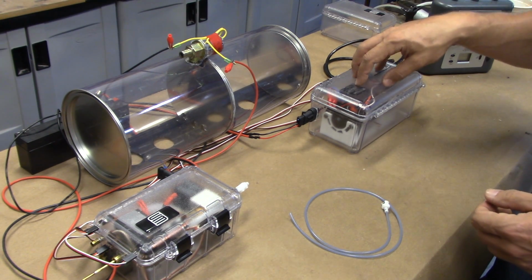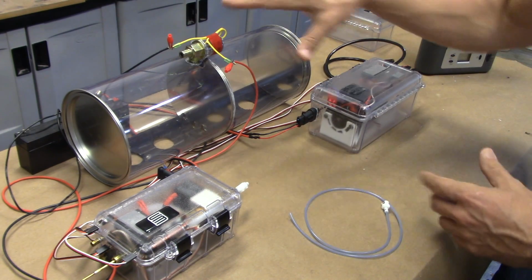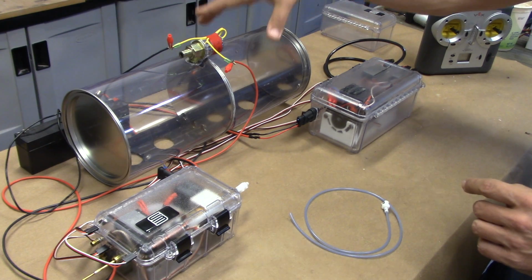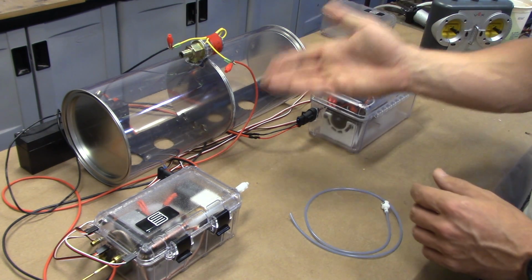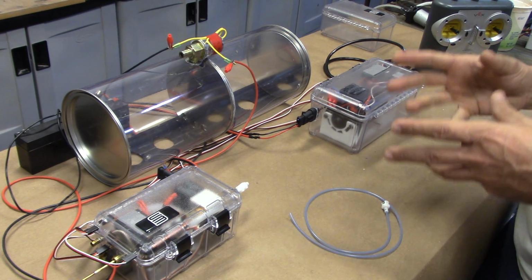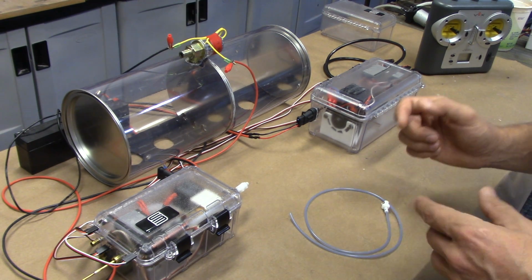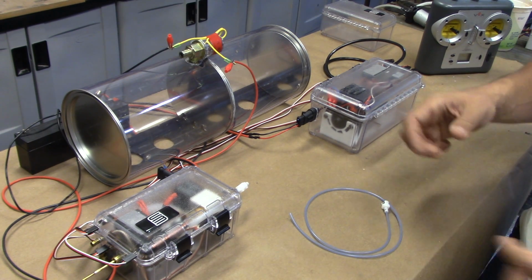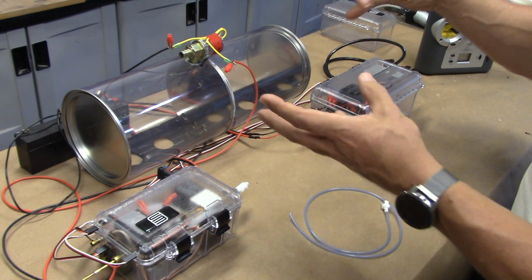They're completely standalone units. We'll talk about the ballast tank first here. This is actually some clear paint cans that I found online, and they are 1 gallon each, so I have a 2 gallon ballast tank. Now, realistically, that's probably going to be a lot more than the George Washington is going to need to get up into surface buoyancy, but as I am not going to be finishing that model out myself, I gave the new owner lots of reserve buoyancy.